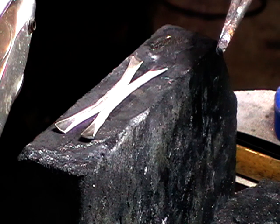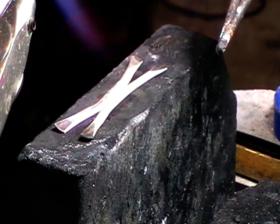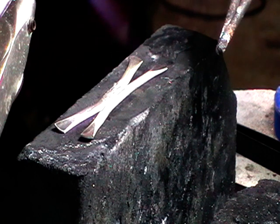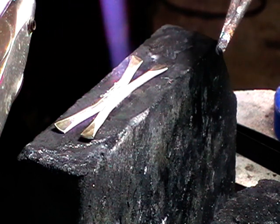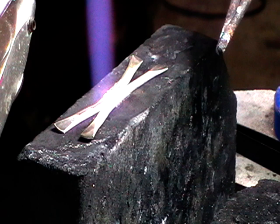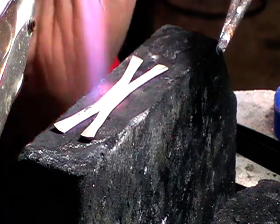Use a nice neutral flame, but for those of you that just have an LPG or an acetylene torch, just turn it on and use whatever size flame you want. Dry out the flux and keep your solder pick in your hand in case you need to push things around. Both sides of your ring need to be the same temperature, so move straight down, back and forth. The flux will go clear, and then the solder will flow.